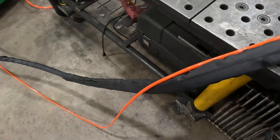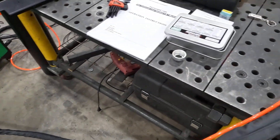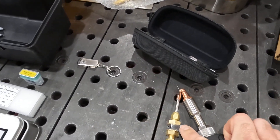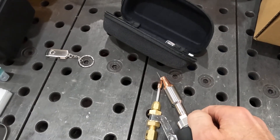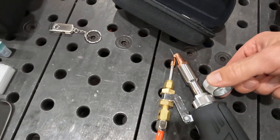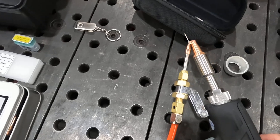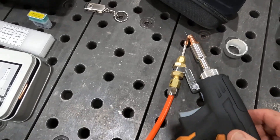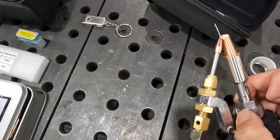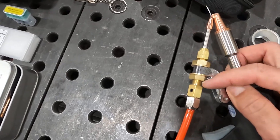Here's a look at the gun itself — it's got a sheath on there. The conduit is removable, so if you're only using the cleaning part and not the welding part, this end threads off. You can pull that off and install the cleaning consumable right there. That changes your gun from cleaning to welding mode. This end is adjustable depending on the tip you put on there as well as the joint configuration — it slides in, it's a collet that tightens up, and you've got quite a bit of adjustment available.